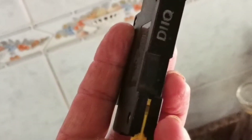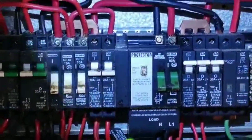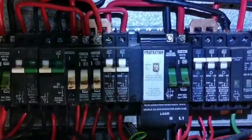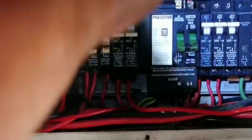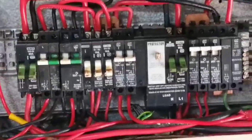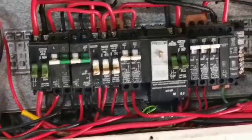You just push it onto the DIN rail in the back and it should sit. Then you put everything back. The new circuit breaker is in — the link at the top is connected and the bottom is also connected. That's how you put in a new circuit breaker.